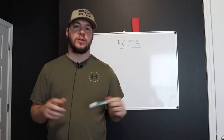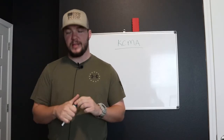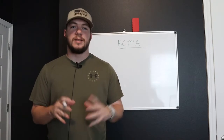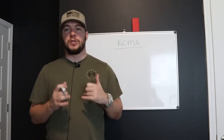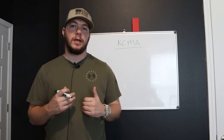Feel free to have your own opinion. I'm sure I'll get downvoted a bunch for this, but my most controversial statement in this video is going to be: Emerald Urethane by Sherwin-Williams does not go on cabinets. It is not a cabinet coating — it is a trim paint. Yes, I understand that you can have success using a trim paint on cabinets, but it's not something I prefer to do, and technically it's not really even right to do.